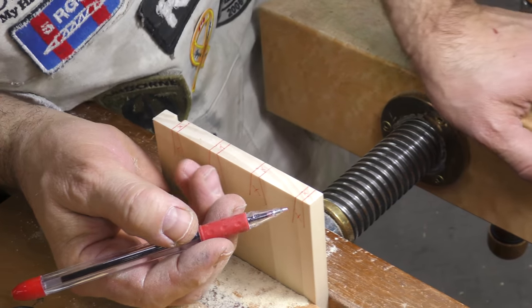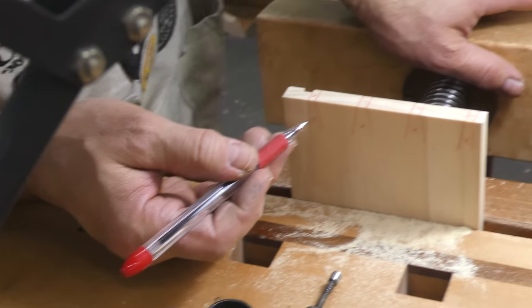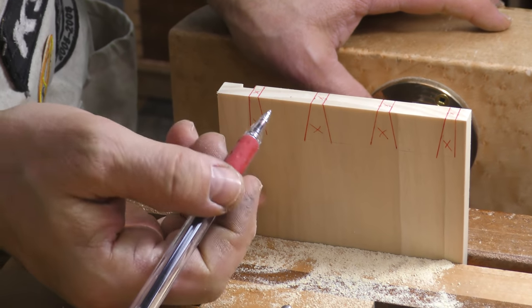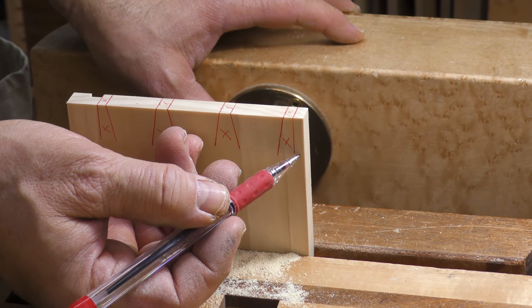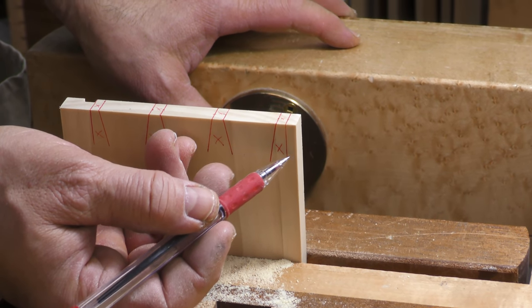Now, why did I leave a plumb cut here? Well, let's explain this one first. The bottom is going to fit right underneath that. So we obviously couldn't cut down into here. We'd expose a gap. Up here, if we sloped it in that direction, it makes this last little bit of the side very thin. So instead, I make a perpendicular cut and maintain the thickness here.